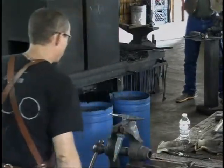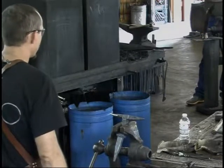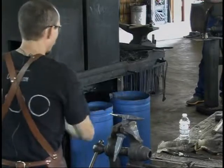And then I threw it in my oven. I heated it to temper. I heated it to 550 degrees. It sat in there for well over an hour as it came up to that, and then it soaked at the 550 for a little while. It was a nice blue across the whole thing where I polished it.